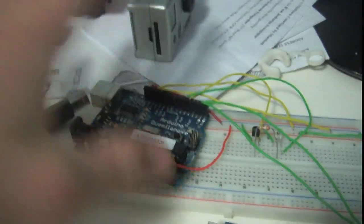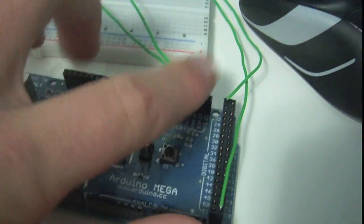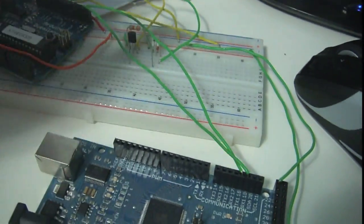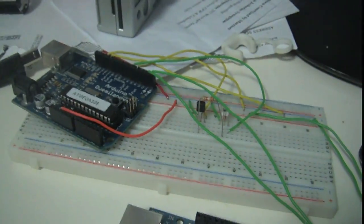So what's going on systems-wise: I have the temperature sensors and the water sensors hooked up to some digital ports. They share the same power over the USB bus. And TX1 — instead of the regular transmit serial port, it's actually a second serial port. TX from this one is connected to RX from this one, and RX from this one is connected to TX from this one. And that's really it.